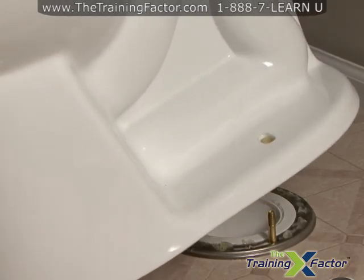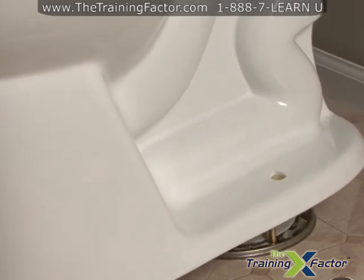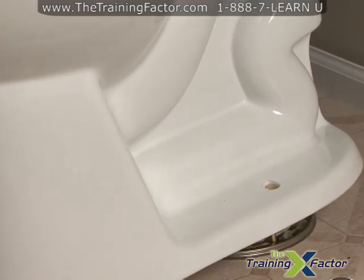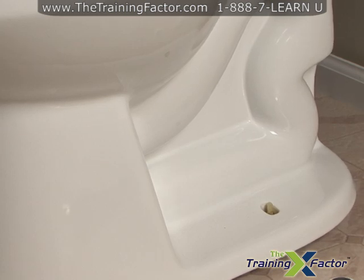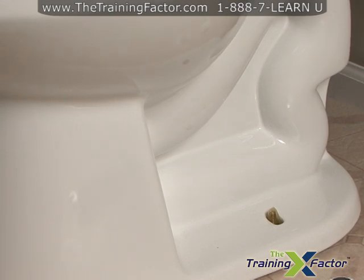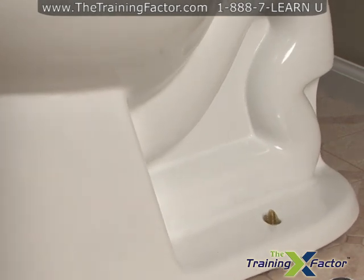The new wax ring may cause the toilet to be taller than before, and thus the bolts may be too short. If necessary, you can replace the flange bolts with longer ones, and then use a hacksaw for any excess after you've completed the installation. As you lift the toilet back onto the flange, make sure the bolts are aligned with the holes in the toilet bowl before pressing down on the bowl.